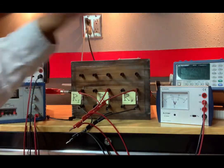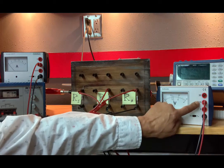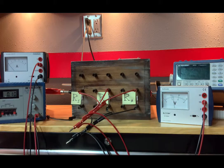And the voltage that I am getting, by the way, you should turn to page 26. That table there is the one you'll be filling out for the data obtained in this section. The voltage, there where it says value, I am getting 6.2 on that analog voltmeter, and the scale is 15. And you should be able to figure out the error associated with that scale. Okay, it's plus or minus 0.5. And the units, of course, are in volts.